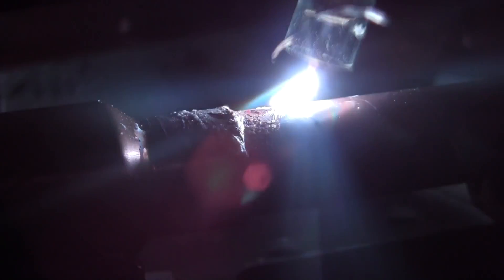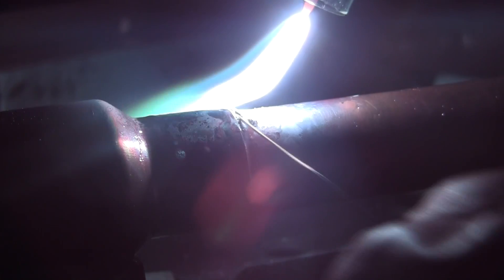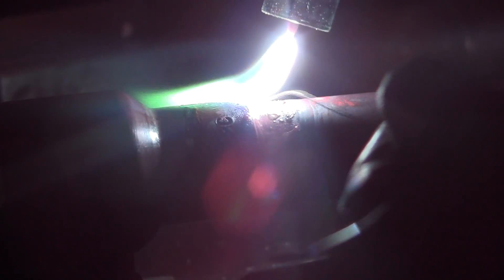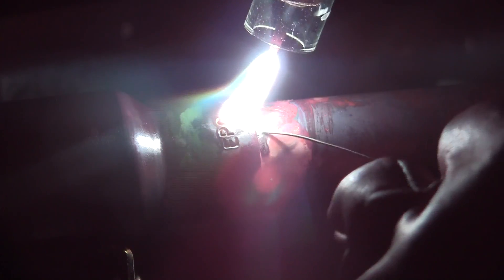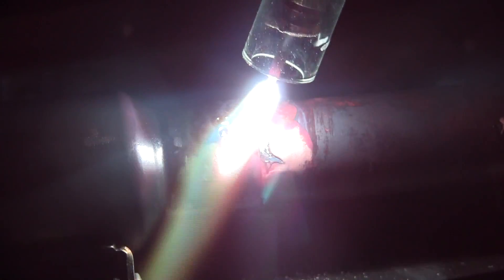Turn around and keep that flame away from the seam. This is the horizontal one. Remember, you can start at the top and the solder will flow right down — the solder will follow the flux and go right through the joint. Just keep it going, dab it in there, watch your heat. You don't want to pop a hole. If you see any kind of real redness, get out of there fast.